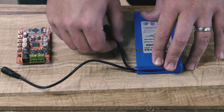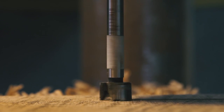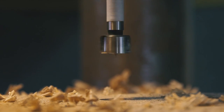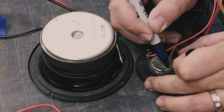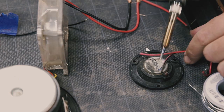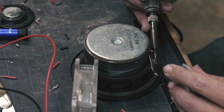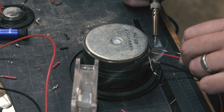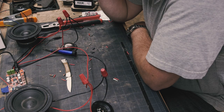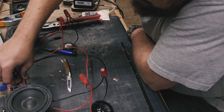I'll have a link in the description to all of the hardware I used, including the amp board and battery, which was the hardest thing for me to find affordably that was powerful enough to power the amp. I desoldered the old leads and added new wire to all of the speakers, then hooked everything up for a proof of concept. The board specified that 8 ohm drivers at 12 volts was optimal, which is what I used, but with the amp gain dip switches set to the full 100 watt output, the board would cut out when the power was turned on. I'm not an audiophile and I'm not an expert on impedance, but my thought is that by adding the tweeters it doubled the resistance, causing the board to cut out. Anyone with more expertise in this field, please feel free to chime in in the comments.